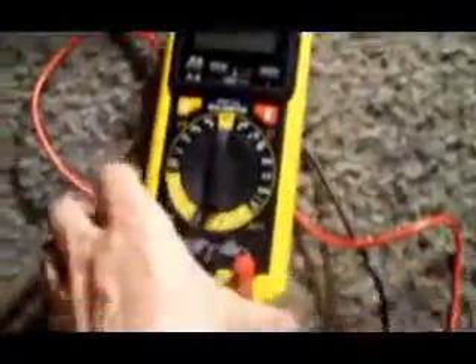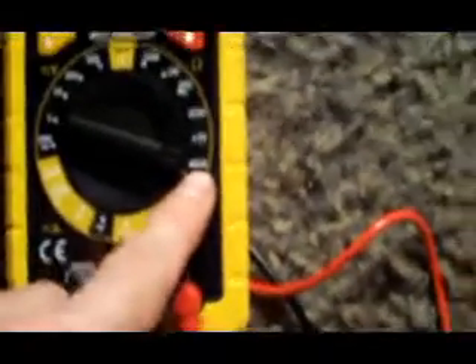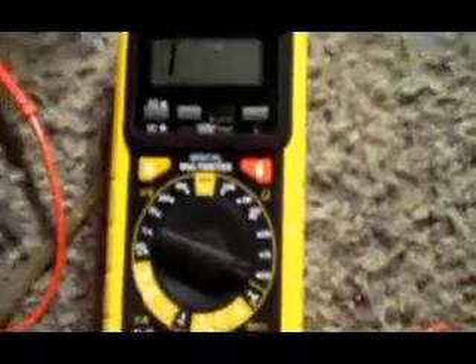Here's all you've got to do. I've got my multimeter — fancy little thing, about 20 bucks at Walmart. I actually bought it specifically to find out the ohms on my Ground Zeros. There's a little ohm symbol on it, and I'm going to flip it to the 200 setting. You plug the two probes in that come with it — you've got your negative and your positive.